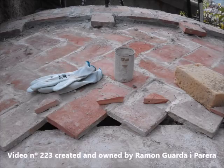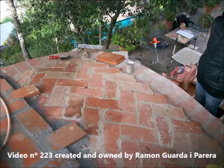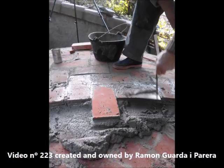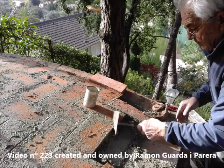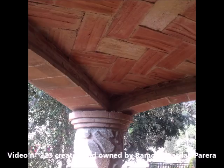We will place these small pieces to continue the second layer. The base must be well moistened in order to continue with the second layer. Remember that bricks 3 cm thick are used in the second layer and placed with Portland cement mortar. The base and well-moistened bricks continue the process of making the second layer. The image shows how the vault is already closing. The final result of our construction of a four-point vault is complete.